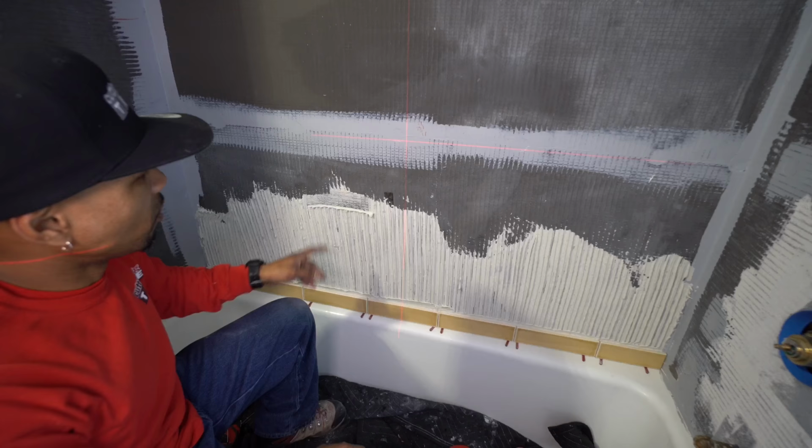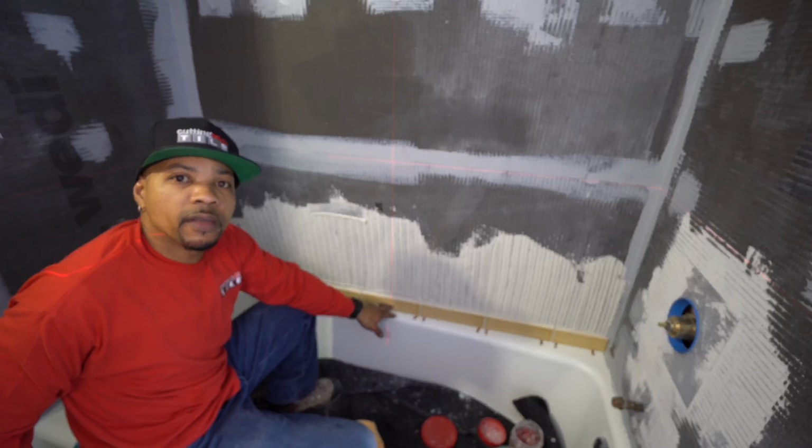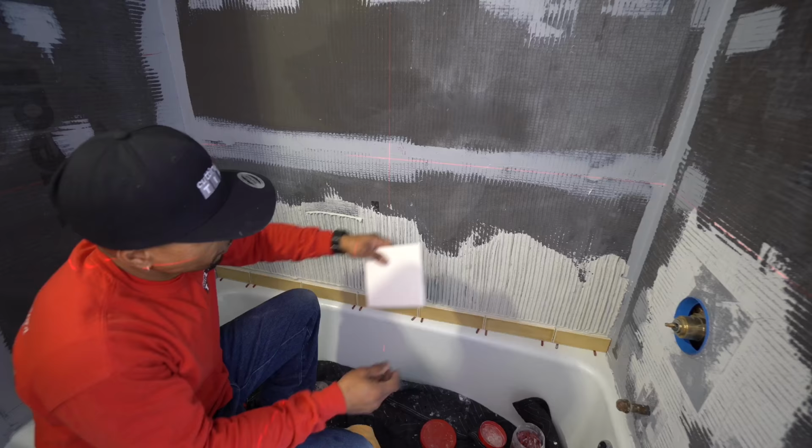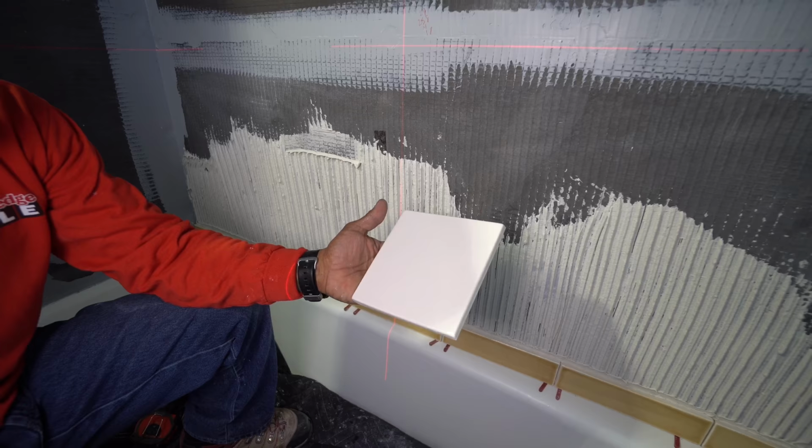You know, I'll walk the tile out from here to here to figure out what cut I'm going to have on these opposing walls and from full tile to this tile. In this shower area, obviously you see we have a 2x9, a handmade, crackle glazed finish ceramic tile. Above it, we will have the white crackle finish. It's another handmade crackle finish tile. We did seal both of these tiles with two coats of our Ocean Care penetrating sealer.